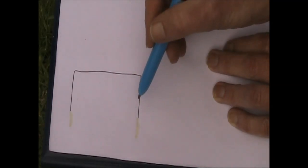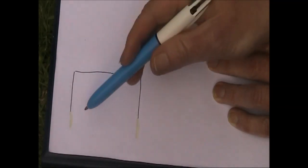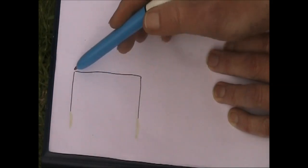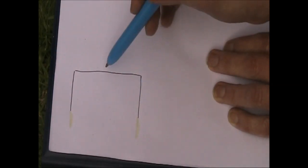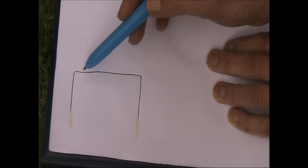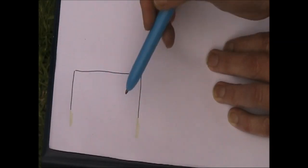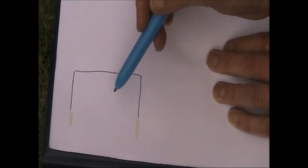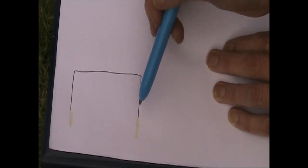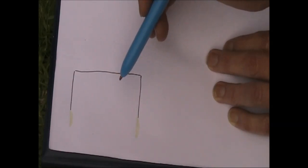Anyway, the half square has a radiation pattern that is broadside, like a figure eight around the longer wire, and in theory it consists of two quarter wavelength verticals separated by half wavelength. So it's the verticals that do the radiating. So unlike a flat top dipole, it's actually a vertically polarized antenna. This makes it a good choice if you are operating by the salt water or even a swamp where you don't have very much height with the antenna, yet the angle of radiation is very low, which makes it great for DXing.